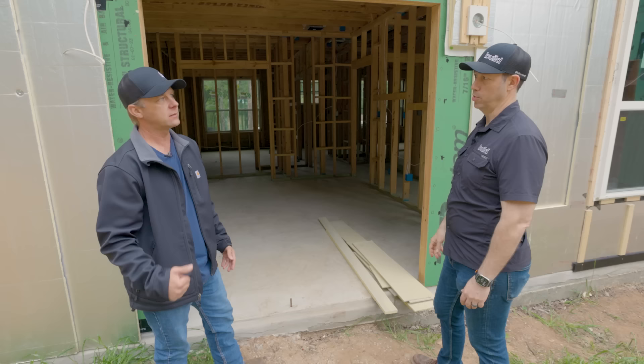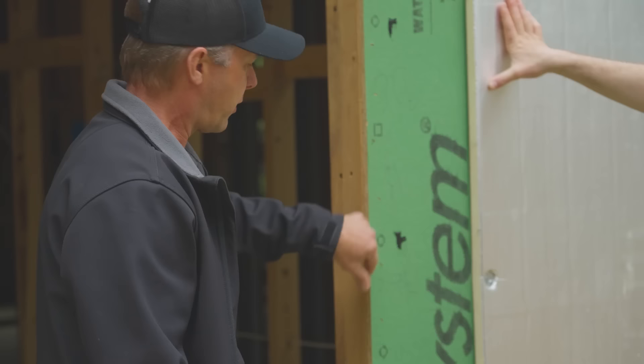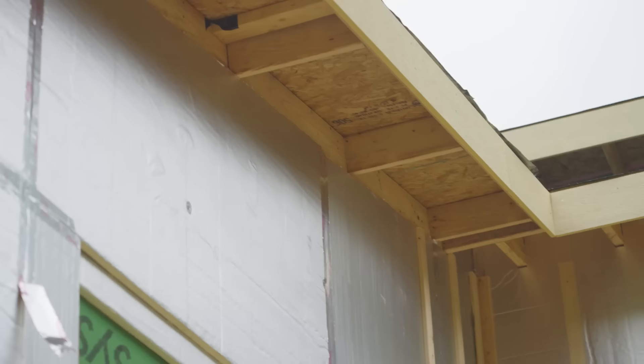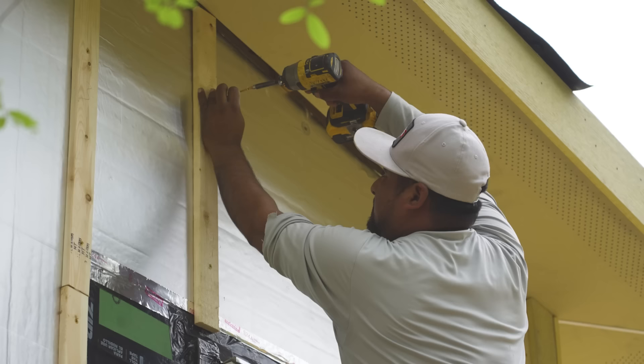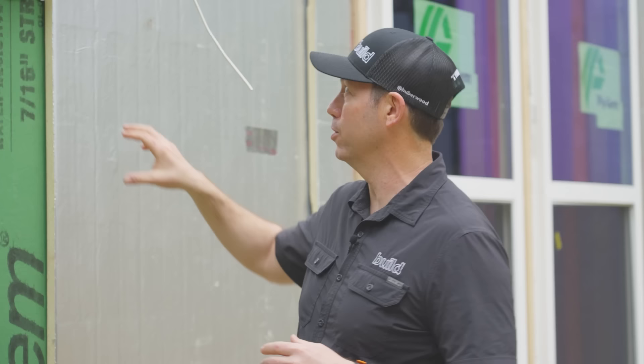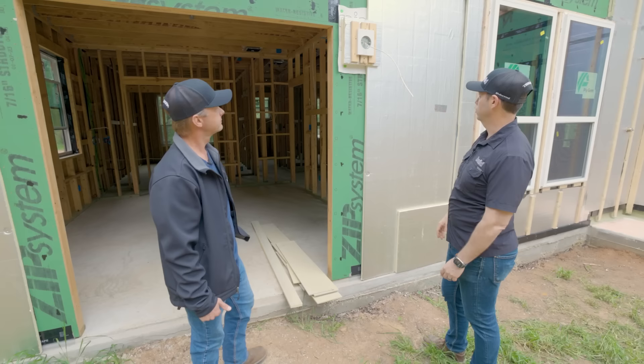I'm not 100% sure whether it's working perfectly — it's not bumping it out that far. But we're not really worried because in this climate, with the little imperfections, we've got some texture and space behind there regardless. You also have overhangs on this whole house — this is not a modern no-overhang house. If you look at the exposure, that's going to decide the system. On this house, your exposure is not that high, although it is a one-foot rather than a two- or three-foot overhang. So there is some amount of water that would get behind a light fixture. I think this is a good inexpensive precaution, and it will certainly be less expensive than using that textured house wrap.